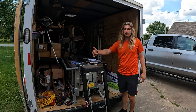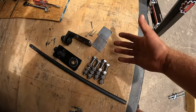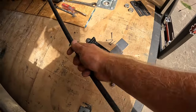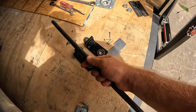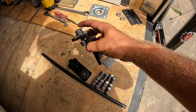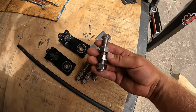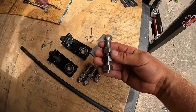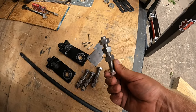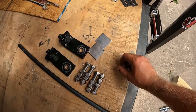Anyways, we're gonna go ahead and move on to the installation process of the gutter miter station. We have our hardware components here that come with it. First things first, we have this 5/8 rod. This is the mounting rod that gets installed in between our two L brackets. These L brackets get mounted directly to the gutter machine using this bolt. Right here we have our fine tune miter saw height nuts and bolts. These get installed on the main rails and level out the saw to make sure that when the gutter runs out, it runs nice and even with the gutter machine.